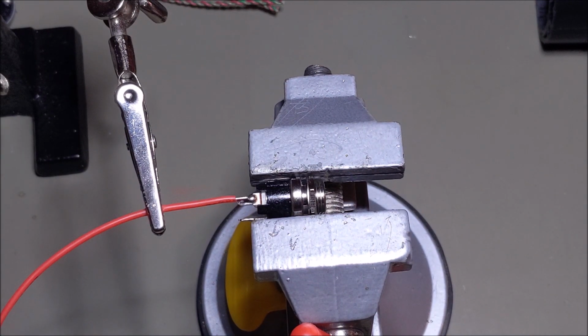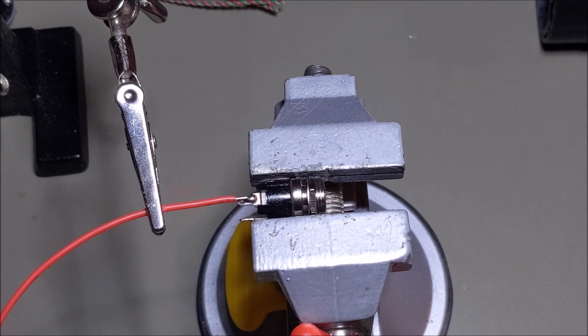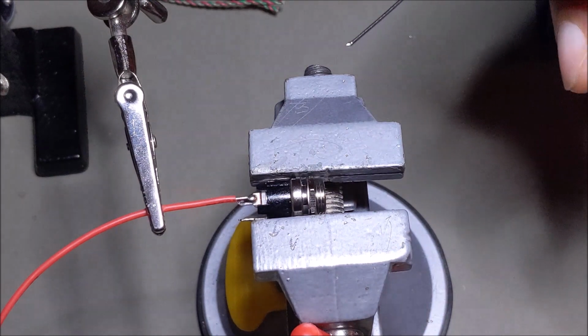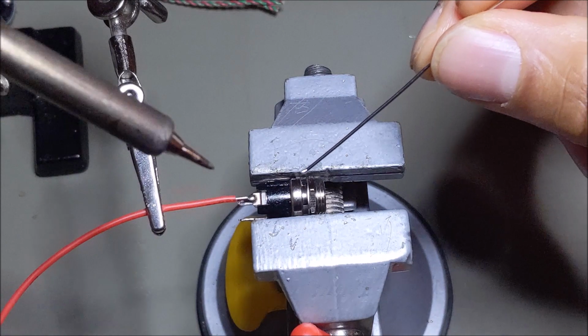So I've got my board negative, I have the battery negative black, and I'm getting ready to solder the positive here. And when I do this, I will have just a little bit of exposed wire, because these prongs are pretty long, and I want to make sure that sets along the length of the prong there. And then what I'll do is seal that with some heat shrink.